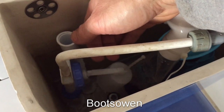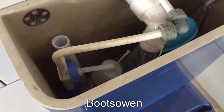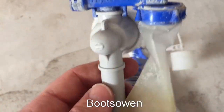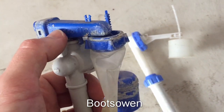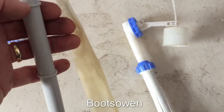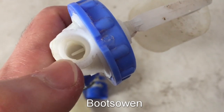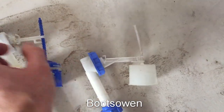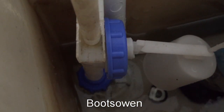It'll move this little float valve and it will stop it. That's just a standard float valve from a toilet — a float valve just like one of these. The water comes up from the bottom, through the valve, and then out over the top through this blue bit and down through this bag or sleeve. This one has been taken apart so you can see the water just comes out of this. You just need a way of pushing the pipe in there — I use 10mm plumbing pipe. It turns out that if you cut the top off this, you can push 10mm plumbing pipe straight in.